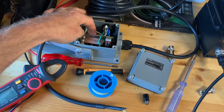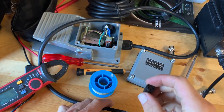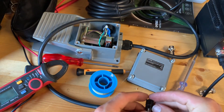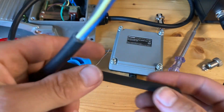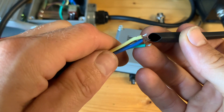We can see here the brown and the yellow are for the switch — those come on pins three and five. Five is here, so it's over there, so there comes the yellow one or the brown one. Five is over there. I have some new solder socket here — it's much easier if I have more space for soldering the wires.